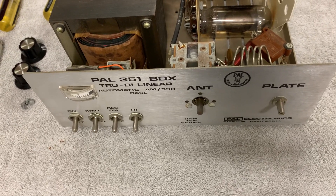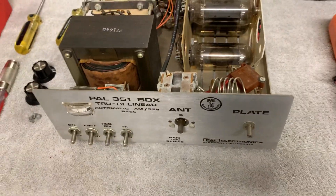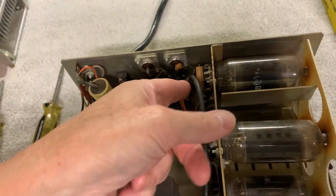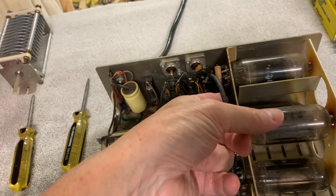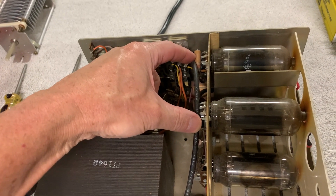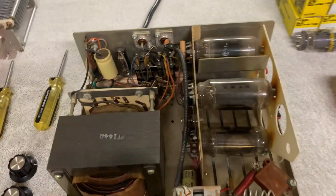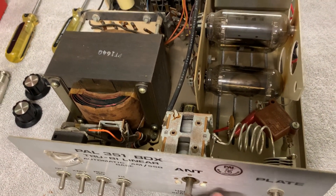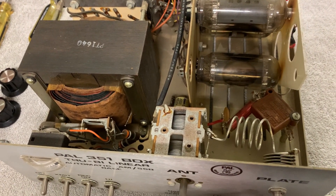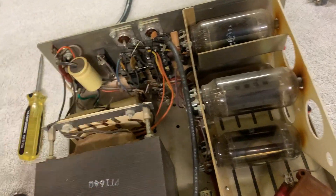What's the bottom end of 20? Is it 14.150? I can get it to work down to 17 — I know that's not going to be a problem. It's just can I make it work all the way down to 20? Because the issue is the input tuning to the first stage and the coupling between the first and second stage — it's got a pretty broadband tuned circuit in there. I'm going to have to make it broader to cover 17, and a lot broader to make it for 20. I think I can make that circuit broad enough from one end to the other, but I might have to put a selectable capacitor — maybe two different ones — and maybe add a switch to increase the inductor so I can tap it in two or three places. I might get one of those dual-wafer switches and connect the other one to a little relay that switches between two different capacitors. I'll figure it out.